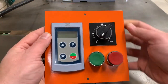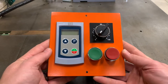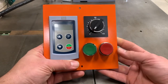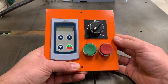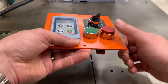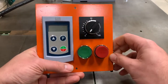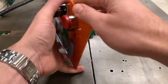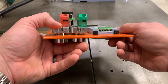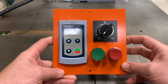Here's how the control panel came out. I'm not sure I'd want this color in my house but it does match the original design pretty well and I think I'm happy with it. This is the remote control for the variable frequency drive. I won't use it a huge amount but I do plan on using variable speed for doing things like blade tracking adjustments. I've got a green start button which is protected by the bezel, and a red stop button which extends up - if I get in trouble I can mash that and stop the machine quickly. This will control the motor speed. These are all parts from AutomationDirect - they are really great Legos. The buttons are just held in by some set screws against the back of the panel. I think this came out really well. I'm going to get it wired up and we'll do a test run of the motor.